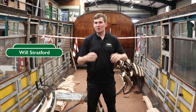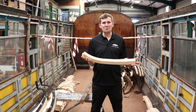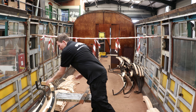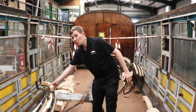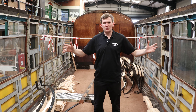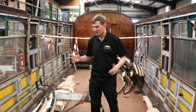Starting off here in the carriage works with our bullet coach. Last time we were in the woodwork shop machining a couple hundred bits of wood to go on part of the roof. These essentially slot into the metal bars which are the roof hoops — line them all up and that's what you attach your roof to. You can see the light boxes have been fitted as well. These are the headers — they slot into the top of the coach framework, and if these don't fit properly, nothing else will fit properly. The roof just won't go on. Bad times.